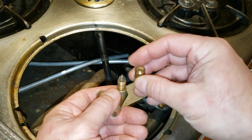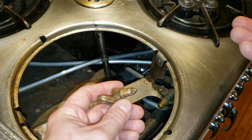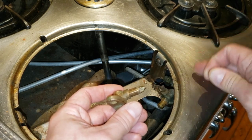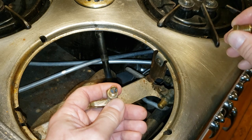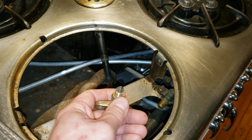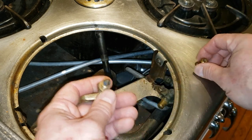If you've got a universal mixing pin in your chambers, you're going to have this cap screwed all the way down so that only that tiny little hole shows through the cap hole. If you've got natural gas, you're going to loosen it for optimal airflow. On propane, you have one setting for the cap, and that's screwed all the way down.